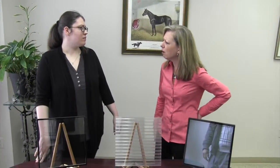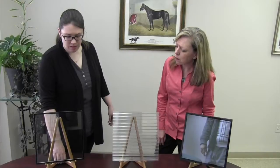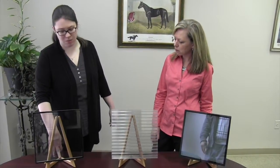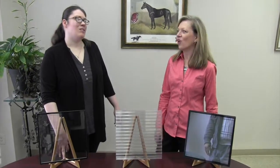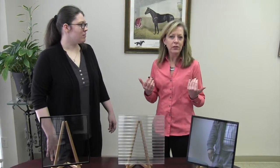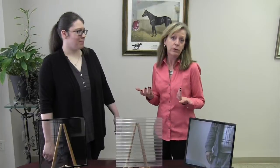Do we know what the R-value is? It depends. The R-value or U-value depends on the actual makeup of the glass unit. You can have a half-inch or seven-sixteenths insulated glass unit made up of a couple different kinds of glass. The space in between can be filled with air or argon gas, and all of these are factors that play back to your thermal values. You can call us with your specific needs, and we can go over the different options and the thermal values of those.